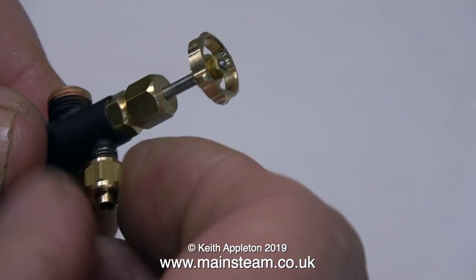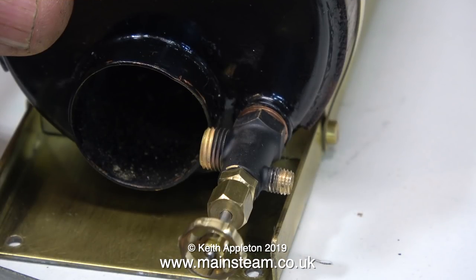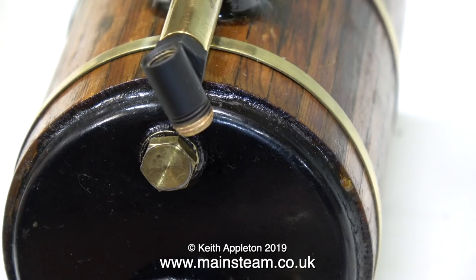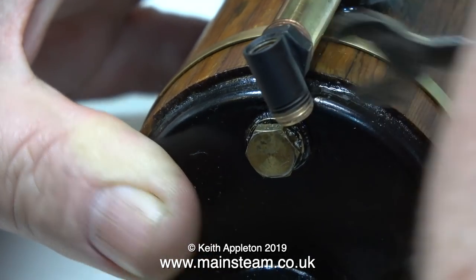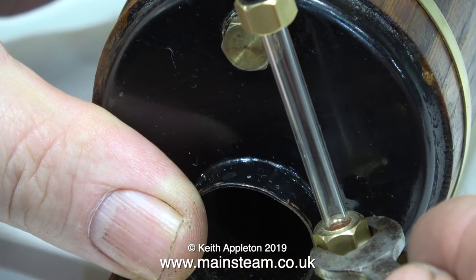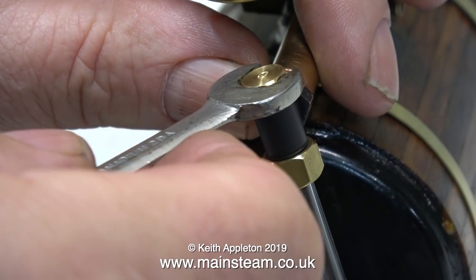The thread in the lower part of the water gauge is for the drain pipe, but there's not much room in the boat so I'm not going to fit this. Here's the top part of the water gauge and I now need to put a glass tube between the two, but first I need to get them to line up. For that I'm using the normal shim washers - just copper washers of different thicknesses that you combine so that when the parts are tightened up they press against the washers. The general rule is you get the part nearly to where it needs to be, and when you tighten the fitting it's in exactly the right position to line up with the bottom one. This takes a lot longer than I'm showing here because you have to try different combinations to get the pressure on the fitting just right. If you don't put enough shim washers in, the fitting will go past where you need it to be, and if you put too many in, you won't be able to get it in the right position. I've done a lot of this so I make it look very simple - it's just practice. If the o-rings are in good condition you don't really need to tighten the nuts with a spanner, but I generally will just nip them up a very small amount. And that's the water gauge fitted.